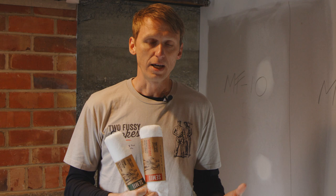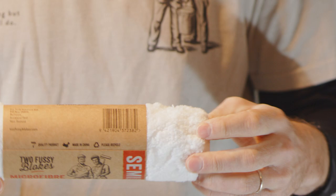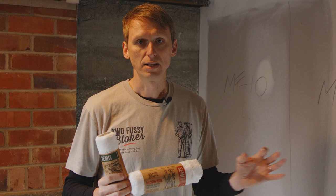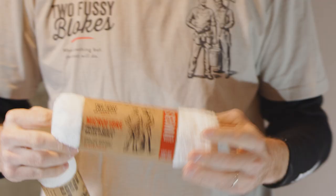You can use them but we wouldn't recommend it. This roller will be fantastic once you have your plasterboard sealed and you do the top coats — absolutely recommending either of those two. Probably 10mm on a new surface, 15mm for already painted or slightly textured surfaces. So let's get to it.